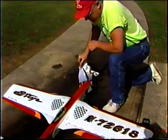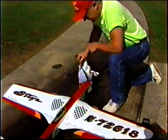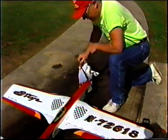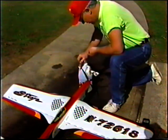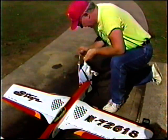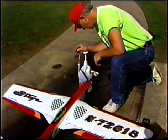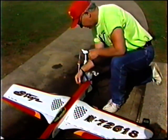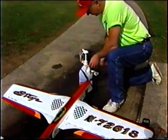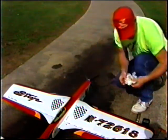I'm very surprised because most motors that'll turn a real high RPM, and certainly this one will, when you try to get them to go down in RPM and grunt and groan, they either run real rough and ratty and tend to shut off, tend to be hard to needle. This one has certainly shown some real flexibility here. Now, what I would imagine this is, if you really were looking to pull a very large or heavier than average plane, this prop certainly would be one of the, I don't know what you would even call it, stump pulling props.